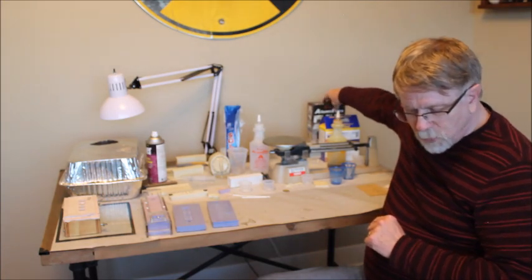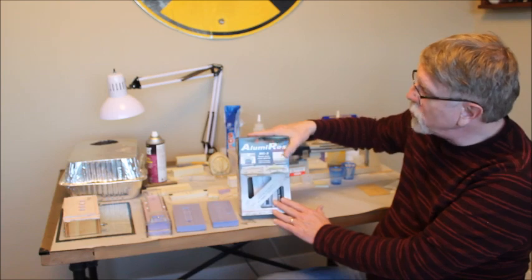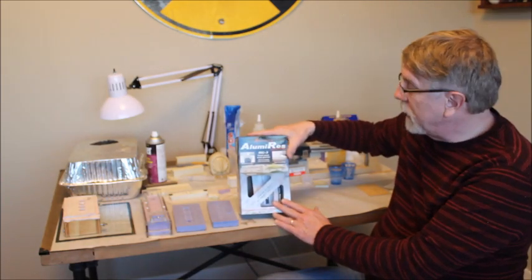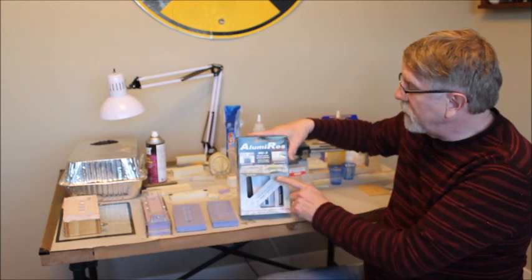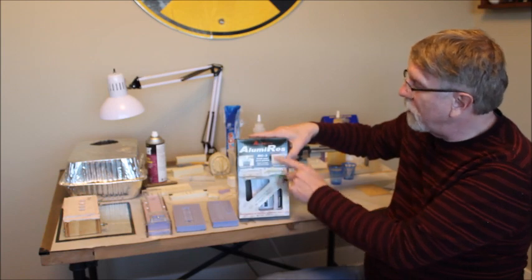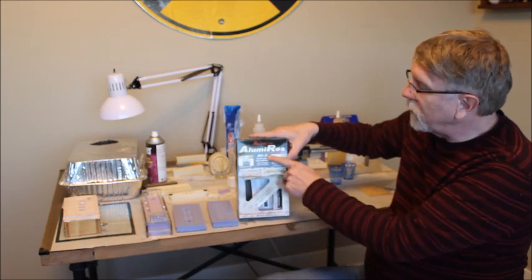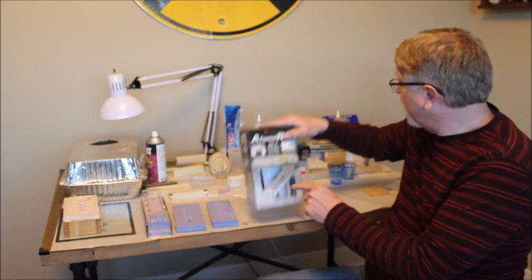The things that you want to look at when you choose a casting resin are the pot life and the cure time. For example, this Alumilite RC3 has a 3-minute pot life and cures in 7 minutes.